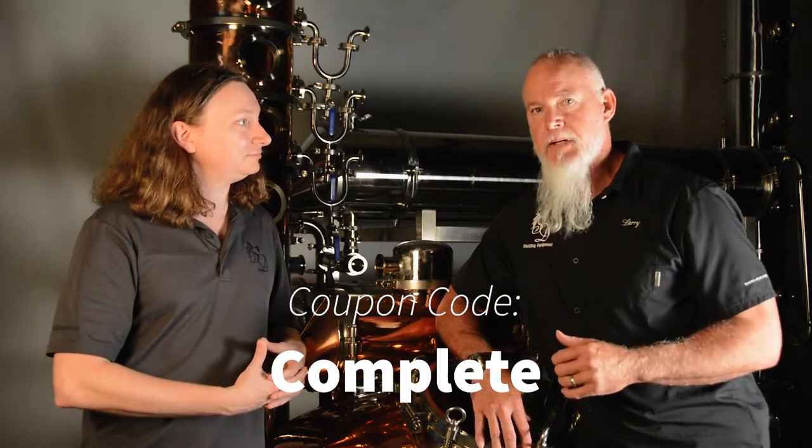The milk can is appointed very well — there's an accommodation for a heating element, a fill cord accommodation, a dump valve accommodation, and the lid comes off easily so you can get your entire arm inside. It's very user-friendly and doesn't need to be modified after the fact. It also comes with our Crystal Dragon column — a glass column where you can actually see everything happening on the plate. It's a 360-degree full view, not just a little sight glass. You can literally stand back 10 feet and observe the column behavior and know exactly whether the system is running well.